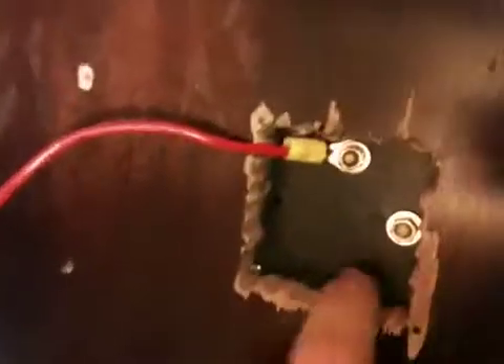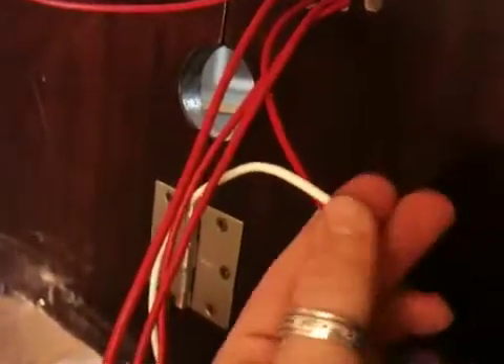This whole unit just swings out if I can get enough slack on the wires. Here's the back of the ammeter — I'll put my other lead onto here and then run it into the charge controller, and you can see my positive line going over to the switch. I'll tie this up nice and neat, and maybe solder that up. That's just an extension cable from the 12-volt cigarette lighter up to the charge controller — the wire wasn't quite long enough. I'd like to use different color wires for positive and negative, but I just used what I had — 14 gauge.